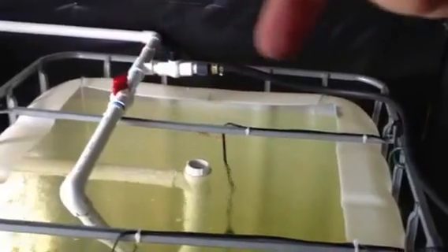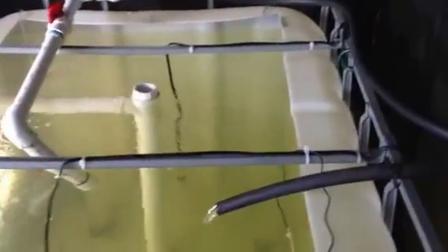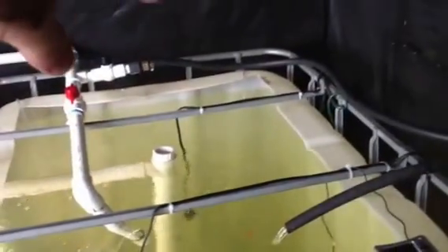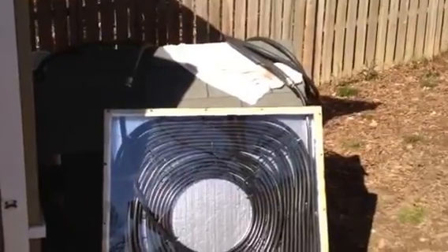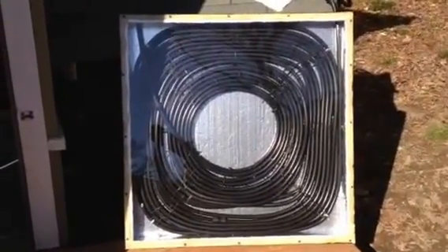To start off, you'll notice over in the back side here we've got an extra hose attached to the main line into the fish tank and a return coming out from here. I've had a problem with heating the water — I've got two heaters in here as is, these two black cords you see off of the metal beams. But it costs money to keep those going so what I've done is created a solar heater. It feeds water off of the main system back here, out the side panel, with holes cut in the wall, to come out here to the main unit. It's a solar box — it has a feed coming in from the shed, goes all around the black coils, then feeds back out to the tank. The box is enclosed with insulation, and the black coils heat up in the sun to about 120 degrees, naturally heating the water.